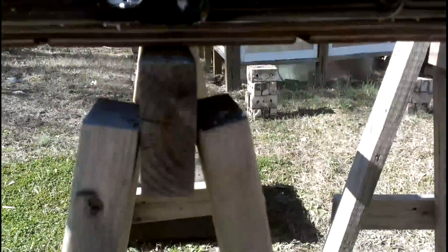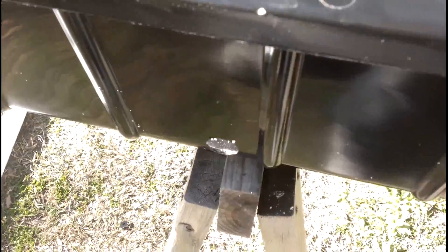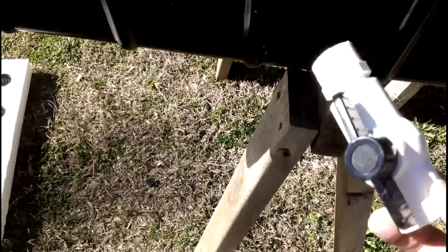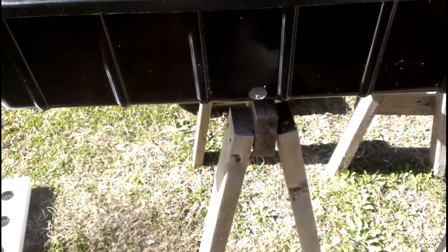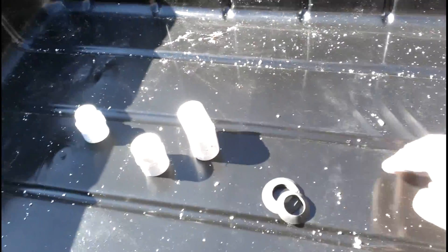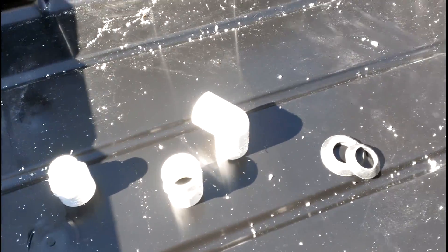Where I'm putting the drain, I place half of the gasket on the inside, then screw it with an adjustable wrench — don't overtighten or you'll damage the plastic threads. We end up with an inlet, an outlet, and a drain line. For the drain you can use a wall valve — about eight dollars with tax — or a regular PVC plug. You can interconnect everything to a single valve to rinse it out and service the system without dumping the whole container.